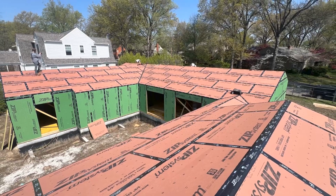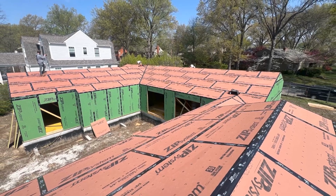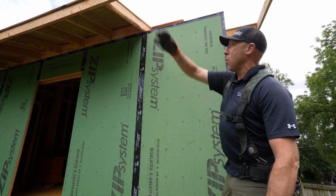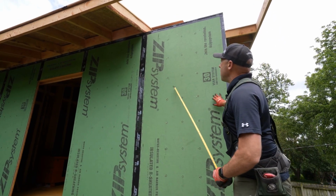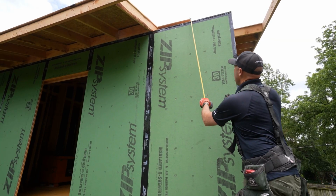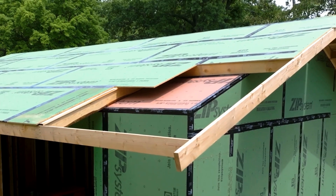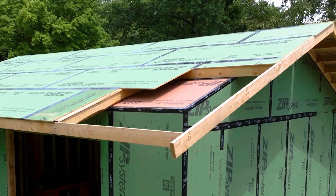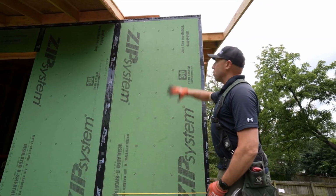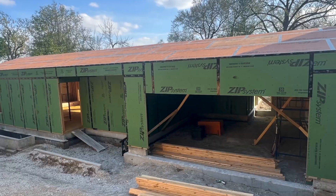Monopoly framing, or perfect wall as it's also more commonly known, is typically where we talk about not having our roof structure extend out over our top plate, but keeping those rafters cut tight, sheathing up the wall to close those off, and then going over the top of that edge with your tape and taping the exterior roof sheathing to complete that air and water control. And I love that strategy.